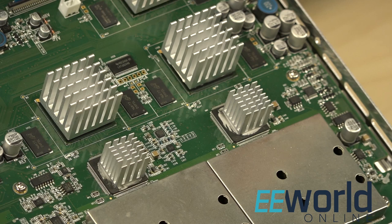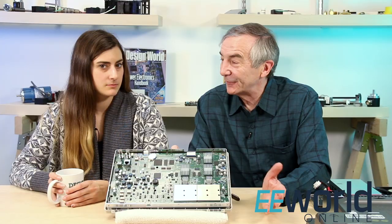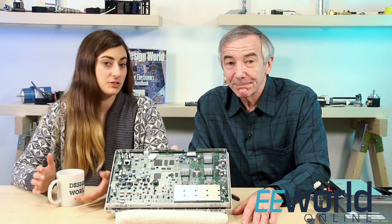Well, that's a good question. I'm not really sure, but those chips have connections to the bigger heat sink chips above them, but not a lot of connections. Of course, we can't see all the traces because this is a multi-layer board with lots of through-hole vias. But from what we can see, there aren't like 16 or 32 connections between the small heat sink chips and the larger ones directly above them. Also, though I didn't precisely count the number of pins on the two smaller heat sink chips, each of them have about 130 pins. With these factors in mind, we can speculate on what the two smaller chips are doing. The fact that there are heat sinks means they have to be cranking along much of the time. If they aren't D to A converters, my best guess is they might have something to do with the scope's built-in function generator.